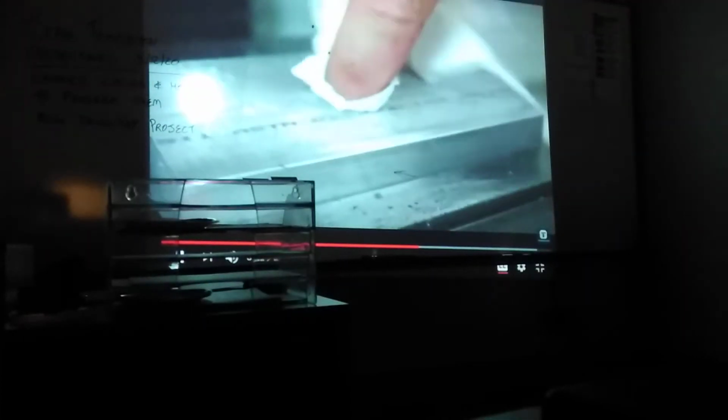Carbide tip? Now he's got a perfectly round precision hole. Now we can take a measurement and then keep adjusting that bolt until he gets to the size that he wants. But you've got to take small increment cuts. You can't take too much, otherwise the boring bar will push off, just like the end mill does. Cutting tools don't want to cut, even though they will. They'll rather push off than take the cut that they need to.